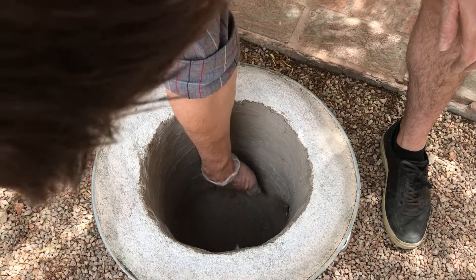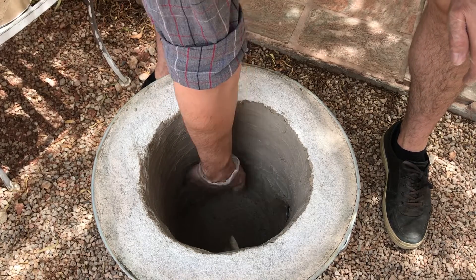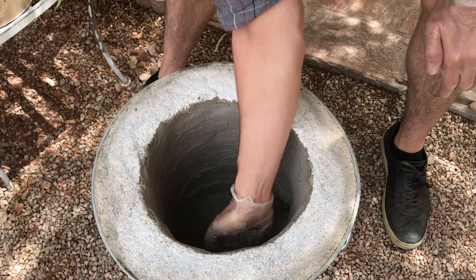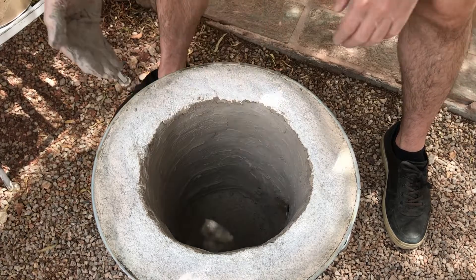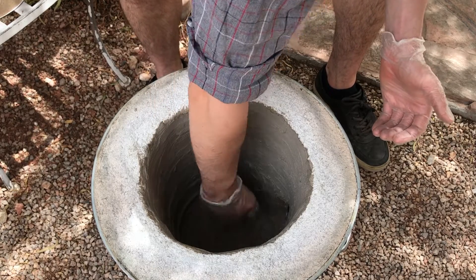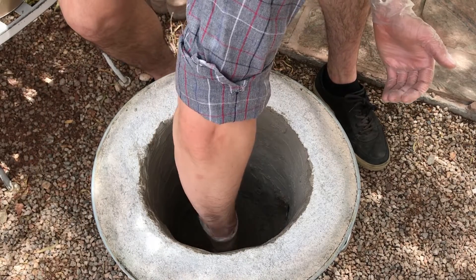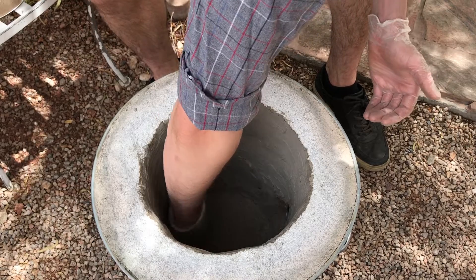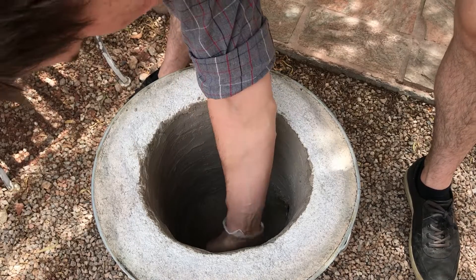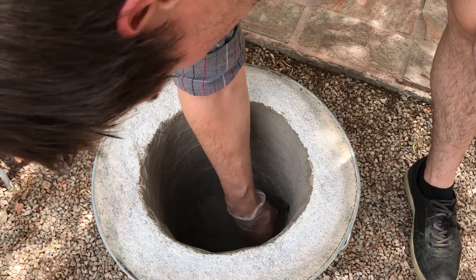To give you some idea, I just mixed up probably two pounds of this stuff, maybe slightly under, and that should be enough to coat the inside and then have some left over to coat a couple of plinths. A plinth is what you put the crucible on top of in your furnace. I like to have one ready after I use this stuff so that I don't waste it, because it's fairly expensive.